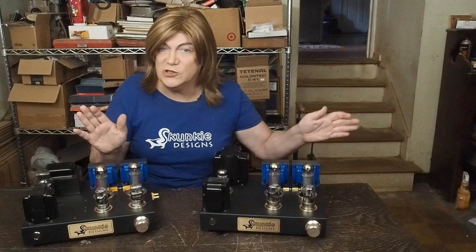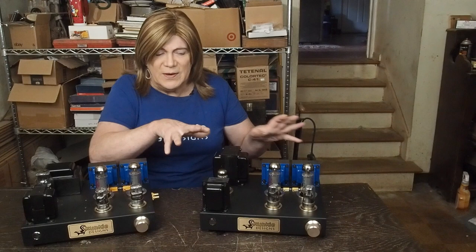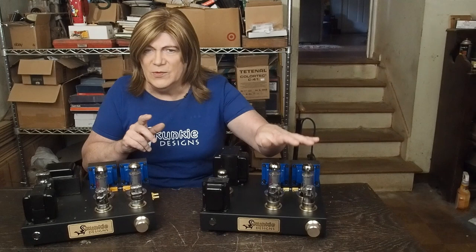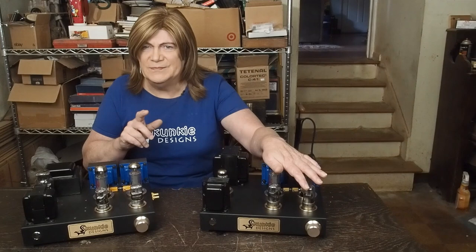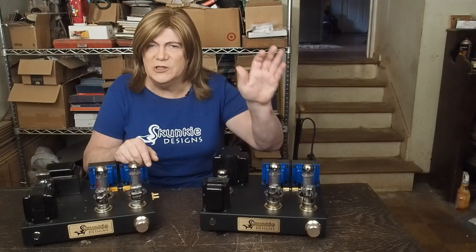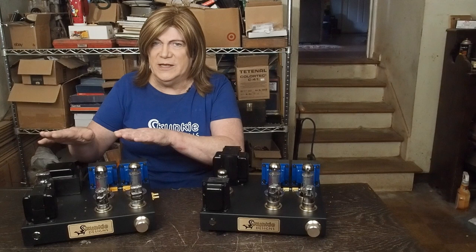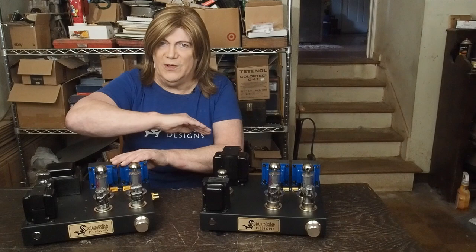So there are a lot of ways to build this out, to play around with the voltages and stuff. And I still want to run the audio analyzer suite with KT77s. I've got some 6CA7s, I think they are. Anyway, all these numbers, too many tube numbers. But I've got a bunch of different tubes that just plug and play right into this amp with the cathode bias. It just automatically sets itself up. The other thing that I want to experiment with, and I'm probably going to do it on this amp, is try fixed bias on the output tubes. But that's for another video series.